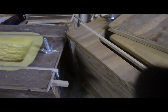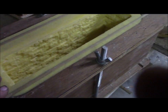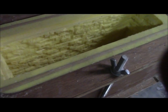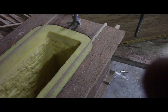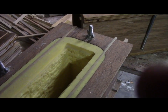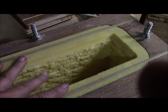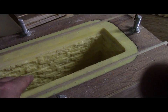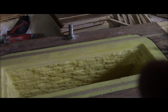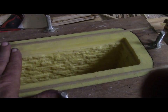After it's done, it looks like this. This has the pattern out of it - that's what the finished mold looks like. You can see the rock sides in there and everything. This happens to be for a straight section, so this is not pie-shaped. After I get both sides poured, I spray it with some separating compound in a spray can so that the concrete doesn't stick to the urethane mold.